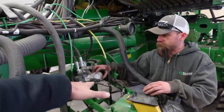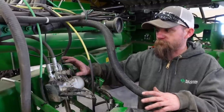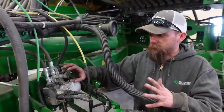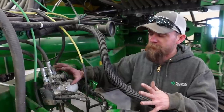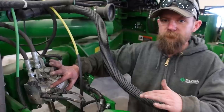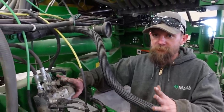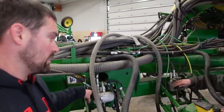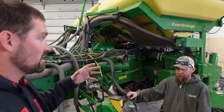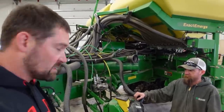These are your pressure sensors for your accumulator. We were doing the accumulator charge pressure test and we had multiple rows fail — about eight of them failed the test. Some of these rows were really chattering, just kind of shuddering. So either the system's not reporting the pressure correctly, or we may still have a little bit of air trapped in the system somewhere. We're going to run through an air bleed procedure again, really thorough, make sure we get all the air out, then run the test again. If a sensor is not reading correctly, it can't calibrate itself and give the correct amount of downforce — it's going to get its signals crossed and not deliver the appropriate downforce as we go across the field.